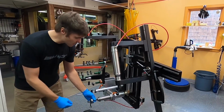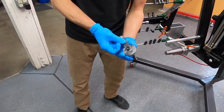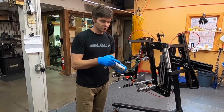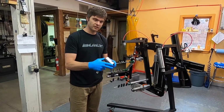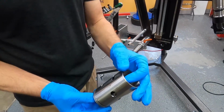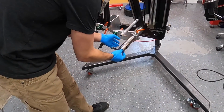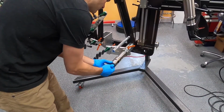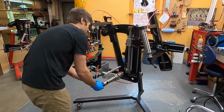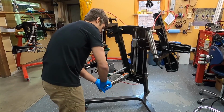And then the bottom bracket, got my own standoffs, caps, and a system for identifying the chainstay location here. And this bike is being built with an 87 millimeter raw length bottom bracket shell. After facing it'll be an 86 millimeter shell width. So it's a T47, a big oversized threaded shell. Also has the full internal hydraulic brake routing, so that's why the large vent holes and such. And I simply eye the position for the vent hole in line with the seat tube. Boom. We'll tighten that down. Good and tight.